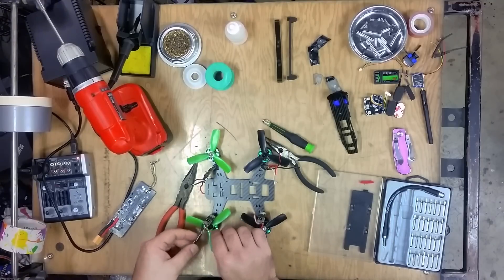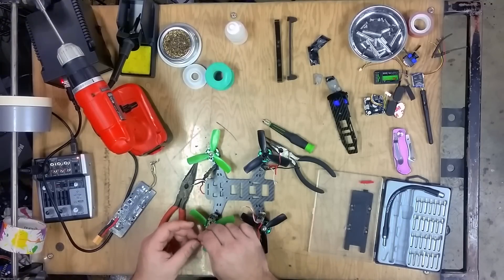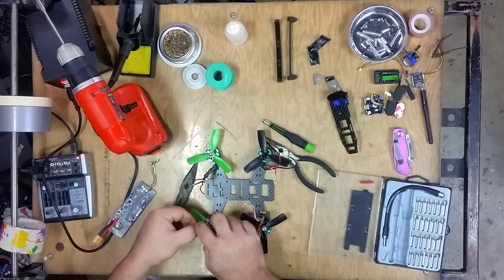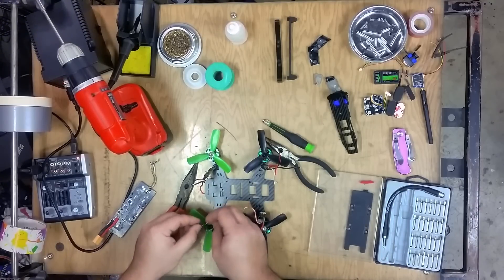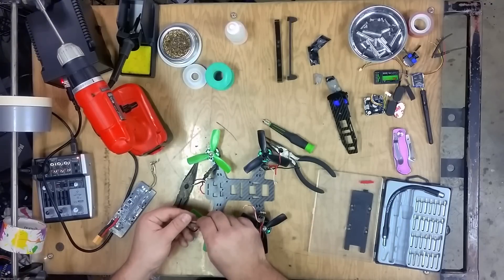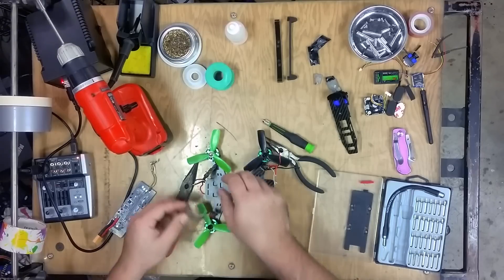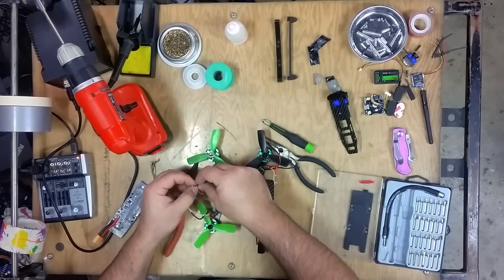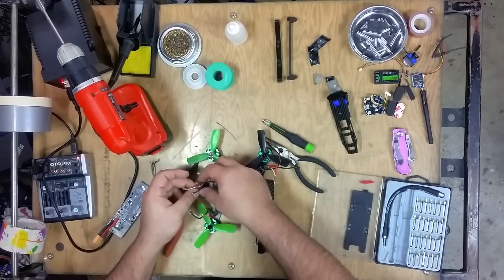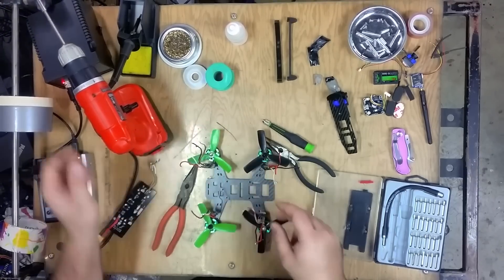This one's a little bit different and I don't really know why — it's the same ESC. It looks like they just removed the red on their own on this one but left the black. I am going to remove those extra wires and clean up before moving on. The white wire is the one you want to save, by the way — that is your signal wire.